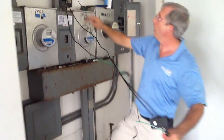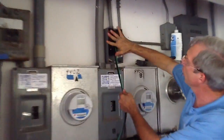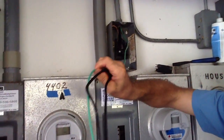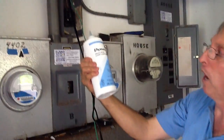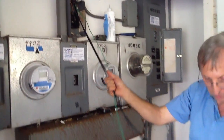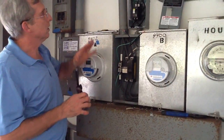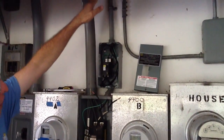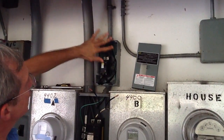Folks, we've pulled in the wire — if you look here, it's all done. We pulled two number eight coppers and a number 10 green ground, and we used plenty of the wire pulling lube. This job went very well. What we've done here is pulled a new circuit in the conduit, all the way back to the new air conditioning unit. This is the Square D breaker and this is the Square D disconnect.